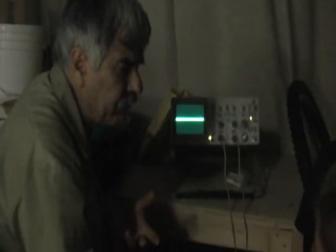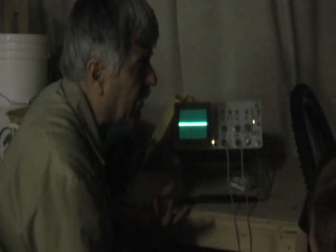Now, what's this per second all about? What's the unit of frequency? We heard that term. There happens to be a car company with the same name. Starts with H. Car rental company. Hertz. Okay. So Hertz is per second. So whenever you say per second, you just call it Hertz, because that German guy Heinrich Hertz came up with a lot of this stuff. So our North American power is 60 Hertz. There's the 60 number, right? European power systems run at 50.